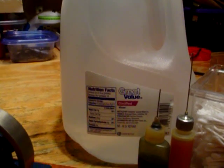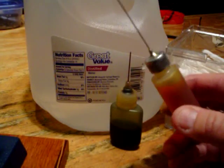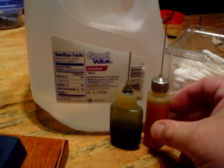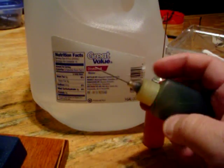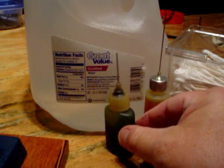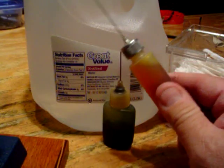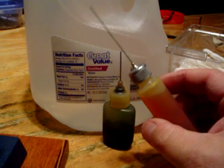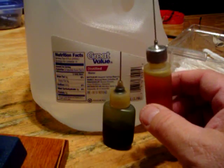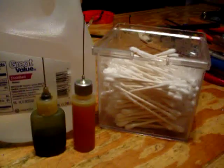Sitting right next to it are two types of oil I use. This is steam oil, available online from many sources — I get mine from an outfit called Green Velvet. This is 30-weight motor oil, used for contact with non-steam moving parts. We use steam oil for contact with steam because it has ingredients that keep it from washing off the metal as quickly as conventional oil. So you use steam oil anywhere steam is going to contact metal, and 30-weight for everything else that's moving.